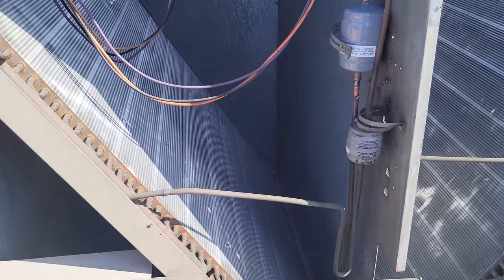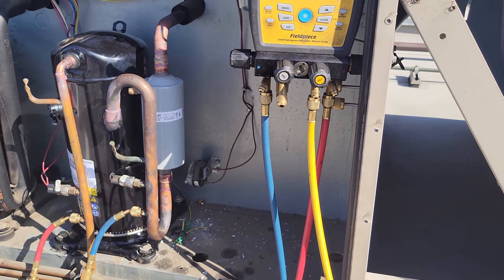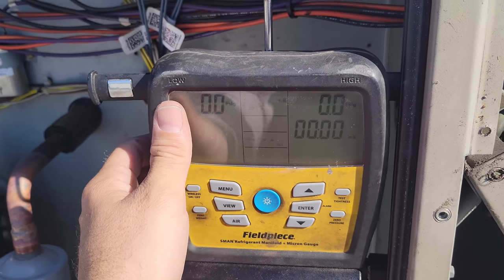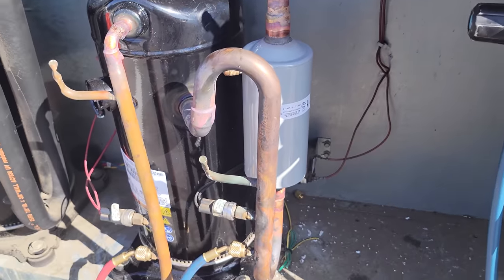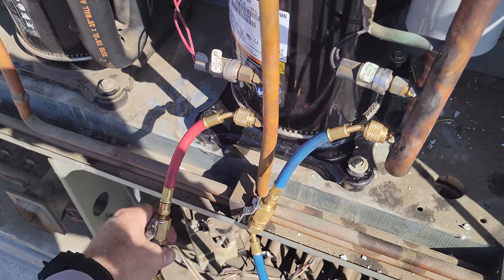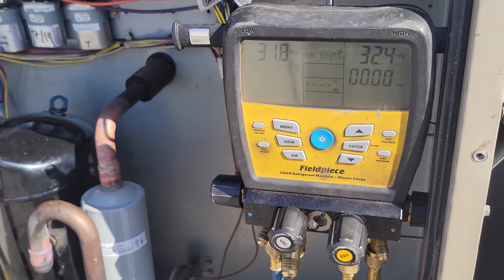We are done brazing. Everything's in. We're gonna do a pressure test on the system. So we're gonna go to the manifold right here. You hit tightness test, and it takes you to this screen. Go ahead and turn on the pressure. We're gonna build it up. I don't have Schraders in here because we're just doing a tightness test, and we're gonna release it and do a proper evacuation. We'll get all that done in a minute.